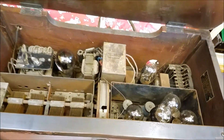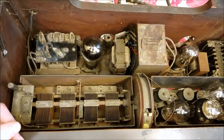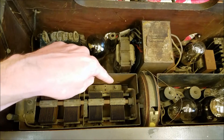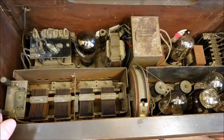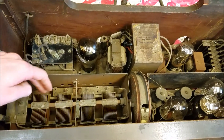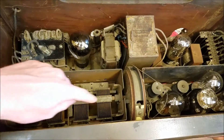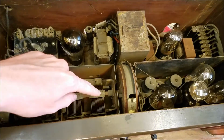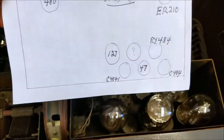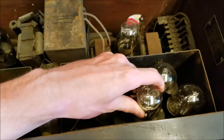Now for the interesting part — this is the tuning and amplifying mechanism. In a TRF you have a filter capacitor and an amplifier stage, then another filter and amplifier stage, and so on. In a super heterodyne you have a filter, then an oscillator associated with tubes. This design is different: it has a narrow band passive filter in front and then a wide band amplifier. That's why I'm suspicious of the 47 there — I'm pretty confident you would not have a 47 in here.